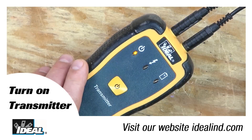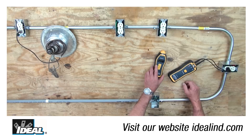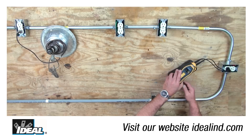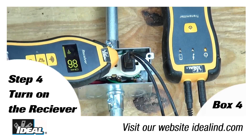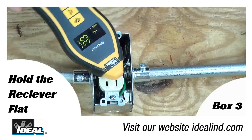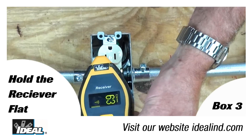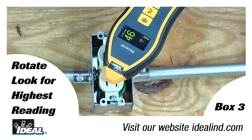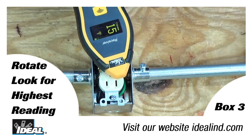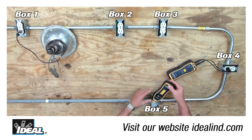Switch the transmitter on and check that the battery level is good. Step four: turn on the receiver and place it close to the transmitter to check that it is sensing the signal. Adjust the sensitivity to get a reading around the middle of the range. Remember, the signal strength the receiver detects varies with the angle of the nose of the receiver to the wire being traced. It is recommended to hold the receiver flat with the receptacle, then rotate the receiver keeping the nose centered on the outlet. Look for the highest reading — if a very high signal is detected, the open is further along in the circuit.